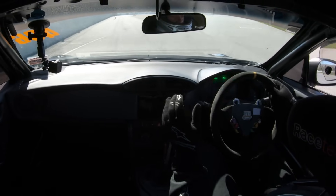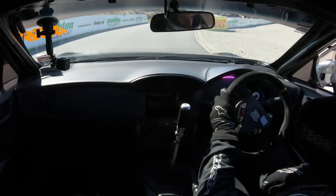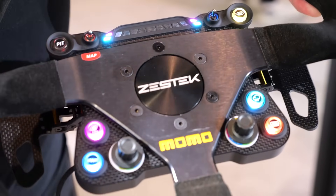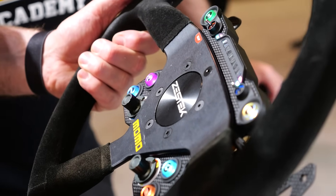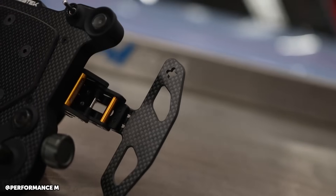On the traditional level you press a button and you're probably only waiting for a dash or something — you can't really visualize it, you're not getting that feedback from the steering wheel panel itself. So for the pit limiter example, when I press that button I want it to stay backlit red while pit limiter is active, and go away when I press it again — yes, you can do that. And likewise, for a momentary switch like a headlight flash, I can press the button, flash the headlights for three or four seconds, and have a LED on the steering wheel panel flash to indicate it's happening — also possible.